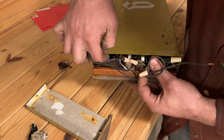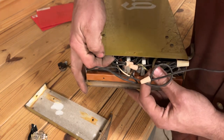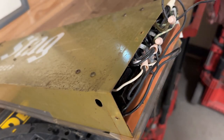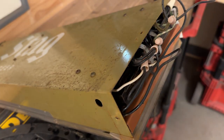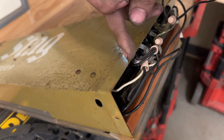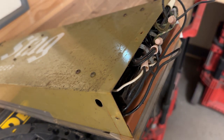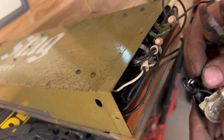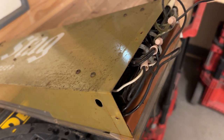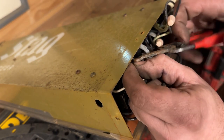The other cutoff wire is all the way in here, right here. I'm going to have to get some bare wire and do some splicing. So our problem is this little pull chain — the original — they left literally no wiring that I can pull to rewire a new one in. This new guy has wiring on it, which is good. What I'm going to do is strip this off and then hopefully find a wire nut. If I've got to rob one out of my panel in the shop, I'll do it just for the time being.